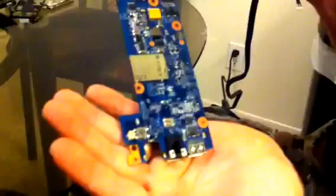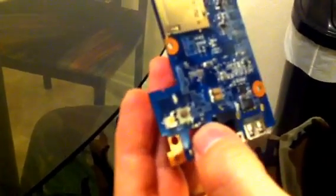The easiest way that I've found to use the solder sucker, the vacuum, is to suck the solder out of the hole and to get the opening ready for it. So let's see right now what I have. This is where the jack's supposed to be. If you can see — I don't know if the video's clear — but there are those three connections right there. I've already sucked the solder out of that hole right there, and I have two left.